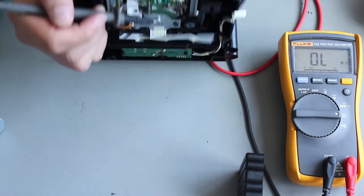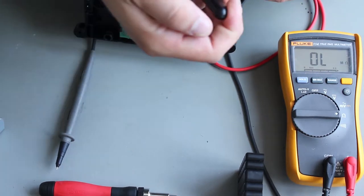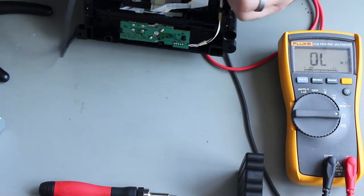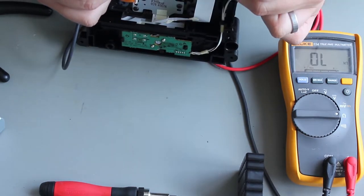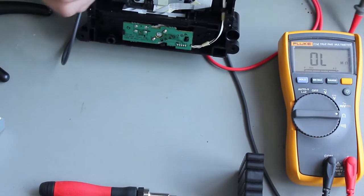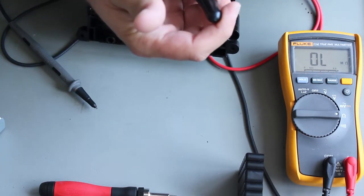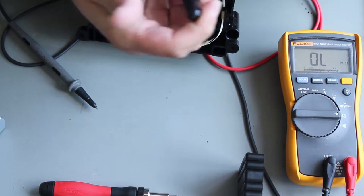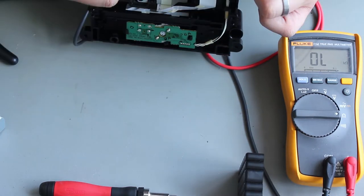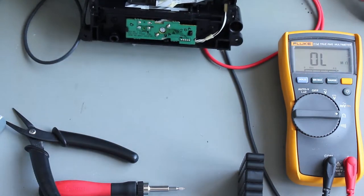Then I'm going to test my laser again. The tricky part is trying to adjust it. Right now I'm turning it anti-clockwise. I'll measure it again - we've gone up to 2.13k, so I was going about 10 degrees in the wrong direction and went up 20%. So I need to go about 20 degrees the other direction. Now it's at 1.4k - going the right way. Now 1.23k - that is roughly where we want to be.